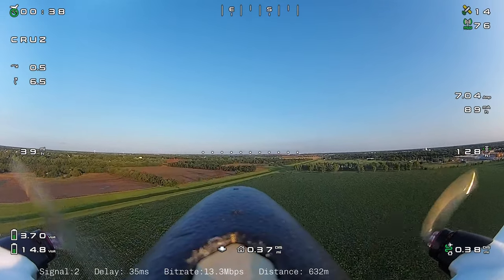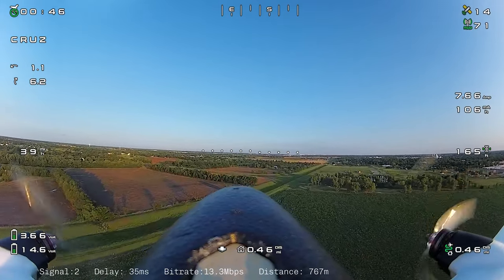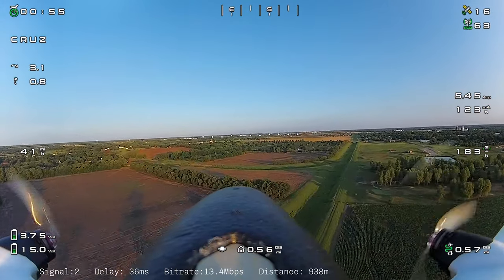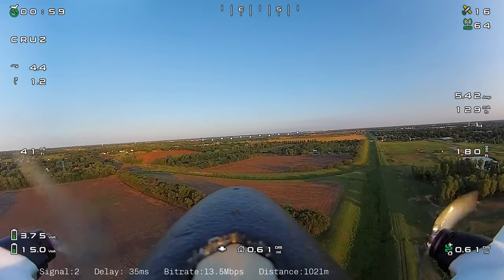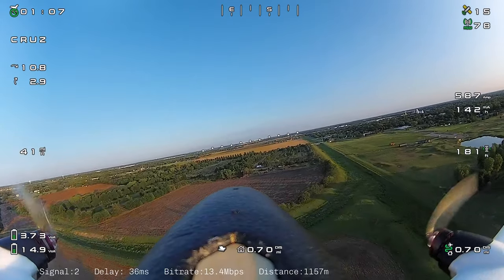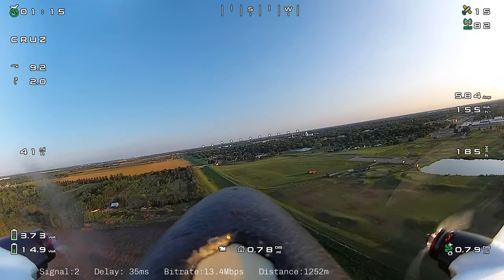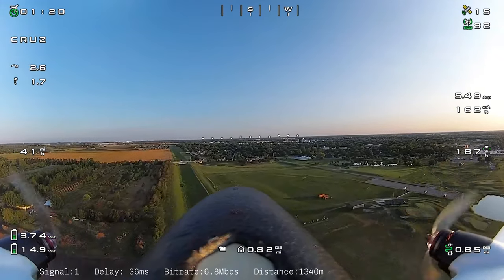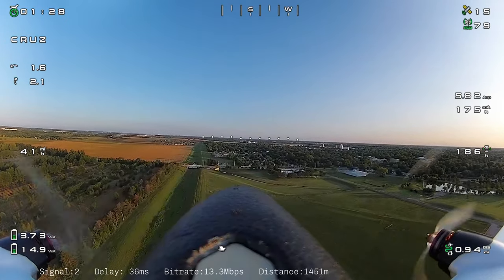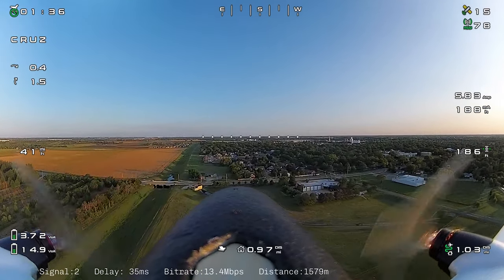Today, we're going to fly out towards the dirt oval racetrack that I had mentioned. I did get a question about my video receiver — I am running the Walksnail Avatar Video Receiver, basically standalone and not with a set of goggles, mounted on a little tripod. Another question I received was what type of antennas I'm running on that, and I have two triple feed patch antennas. Those antennas allow you to run either left hand or right hand circular polarization. I'll put a link in the description for those particular antennas.